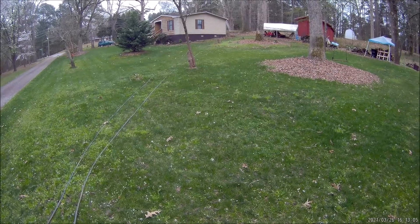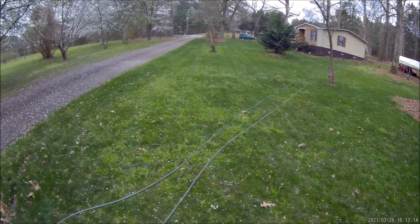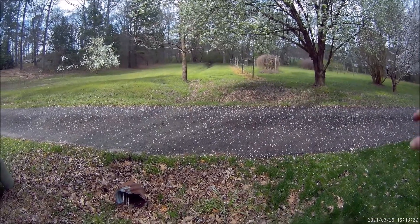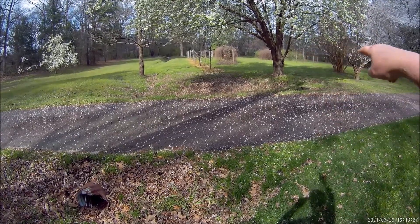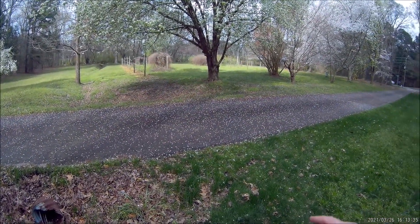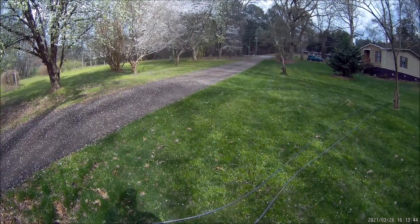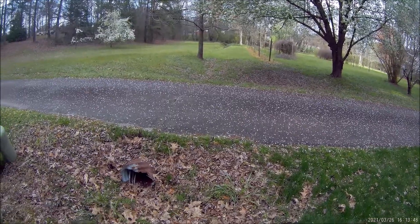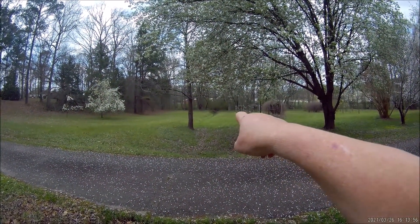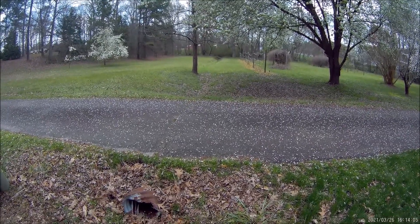Other than curiosity, what is the benefit of knowing if you can attach a downhill delivery line? Well, it's all about ram pump placement. Last year I can't even begin to tell you how much trouble it was with that ram pump I had going underneath the highway and everything — and eventually after I had enough supply line, I had to pump hundreds of feet uphill, an elevation of over 40 feet. This year I'm doing something different. You can see how level this ground looks here from this culvert — a couple of hundred feet down there to the wood line. The elevation between here and there is only about six to eight feet.